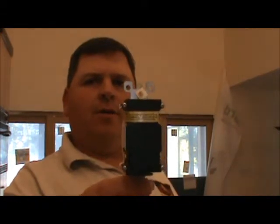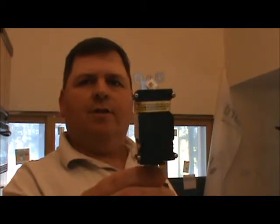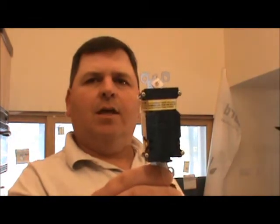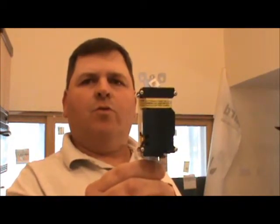So let's take a look at the back of it. If you pull it out of the box, you're going to notice one side has tape on it — all of them come standard that way. There's a line side and a load side to a GFCI outlet. When you pull it out of the box, the load side will have tape around the back of it because it's not necessary to use that side at all times. If you're using this GFCI outlet to only protect this particular outlet, you connect your wires to the line side. If you want to use this outlet to protect several other outlets, those other outlets would be connected to the load side. The line side is power coming in; the load side is power going out.